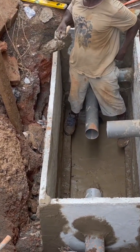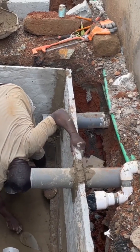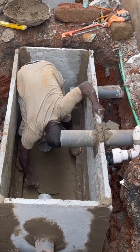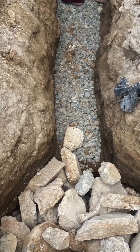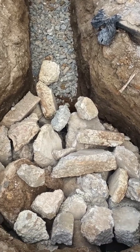If the soil is not good, there are certain steps you must take to ensure that the biodigester you are going to construct works in that scenario. If you go to a site and the clay is significant, let the homeowner know they need a traditional soakaway. After getting that soakaway, they might need a water pump to occasionally get the water out of the wastewater treatment chamber; otherwise the digester will not work to perfection.